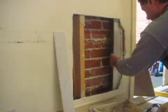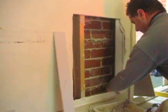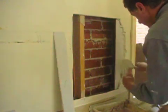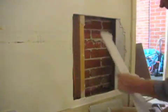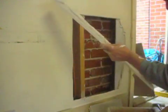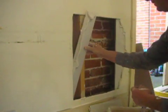And I press it firmly, not too firmly, because you want the piece that fills in to sit flush with the wall. If you go too firm, you don't want the infill to be proud of the wall. So I'd rather have those back blocks set back slightly more than normal, since it's 10 mil plasterboard. If they're set back at 12 or 13 mil, I'm happy, because it allows room for the glue. And then with my trowel, I make sure that it's a flush joint.